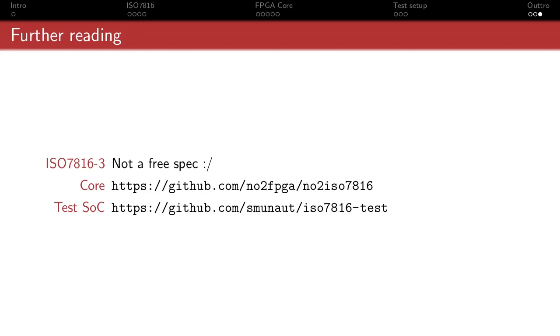My first question would be, why exactly is that wait timer so large? Is it just because the counter value has so many bits? And if so, why can we not just divide the clock first, or does it not make a difference? I mean, the divider also uses the same number of gates.